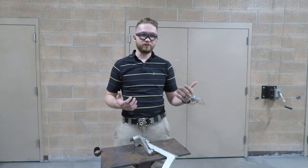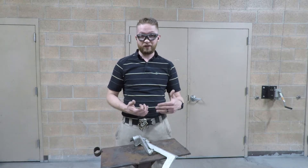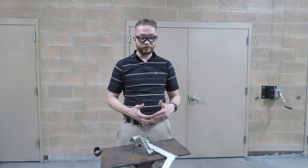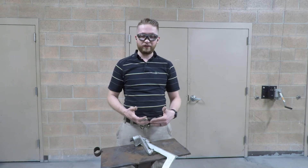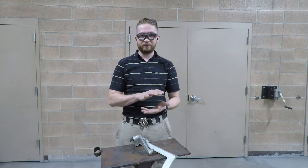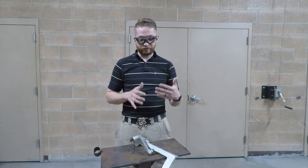To fix cast iron there are many ways to weld it. One of the ways I'm going to do tonight is weld it with a shielded metal arc welding process using a nickel-based electrode. After we grind the edges and prepare them for a weld, we're going to preheat this to 500 degrees, maintaining that temperature while we're welding. I'm going to try welding it from both sides, back and forth, to even out the heat and the stresses.